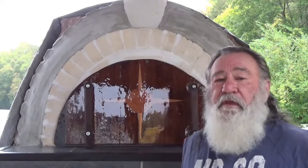There were so many things that I looked at at this point. So many people said once you get your dome built initially, using your high temp mortar, burn it in then, see if you get any cracks. Others said don't matter, just wait till you get the last rendering on before you put any decorative stuff on, burn it in then and check for cracks. And then you had the other third that said just finish the daggum thing and then burn it in slowly. That's the key. Burn it in slowly, because no matter what you do, there will be cracks.